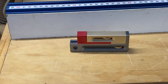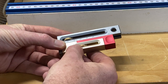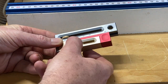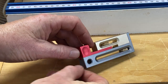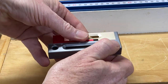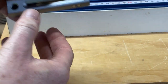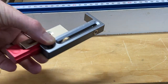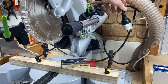No doubt many of you have seen one of these little kerf makers before. This one I bought off Banggood.com, quite cheap, and supposedly quite good — this is actually the first time I've used it. The theory is: you set the kerf, or the width of the blade, using the red portion and the edge of the gray, and then you set the width of the wood you're placing into your dado. The overall unit then gives you two lengths by which you can cut your wood.